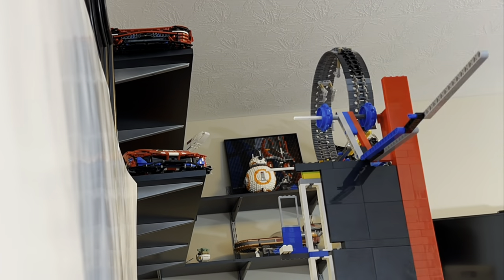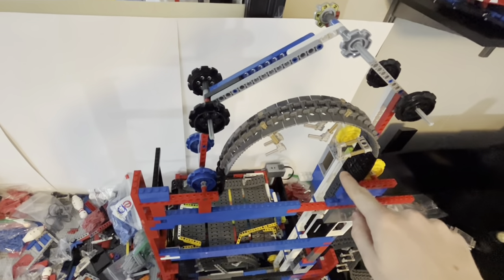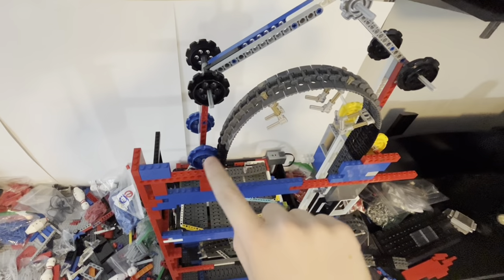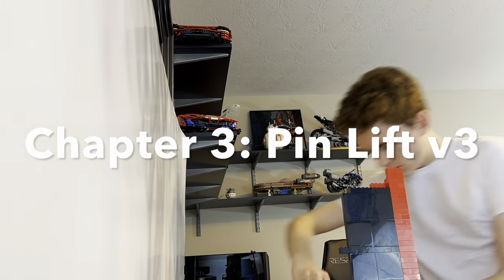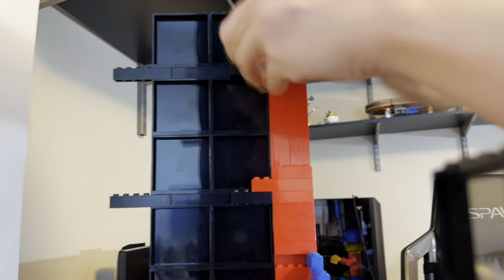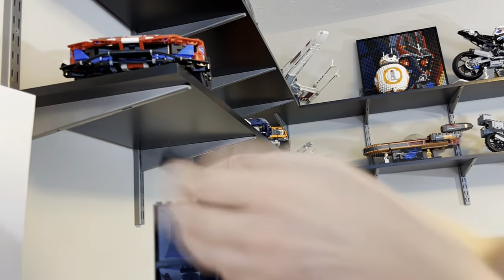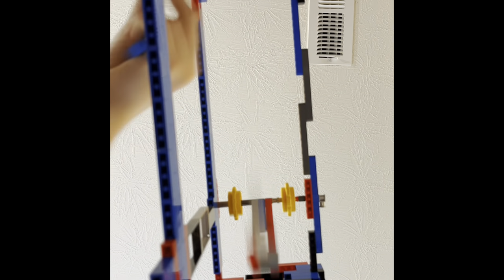The original design uses two wheels and a piece in between to keep it at that 90-degree curve. This new one uses a wheel and a blue wheel on the left to keep it up using tension. But I still hate everything about this. After a lot more redesigning, I finally decided to just go with a simple vertical conveyor belt system — but instead of the normal one, we'll put it at an angle. That way we can solve the challenge of getting the pins off the hooks while still having enough space to orient the pins the proper way for the pin setter.